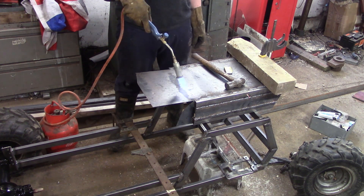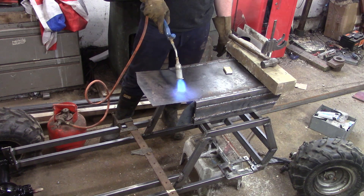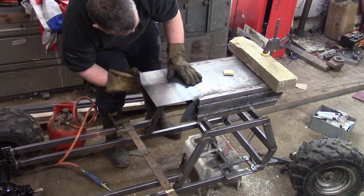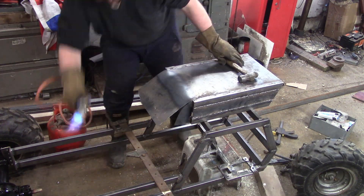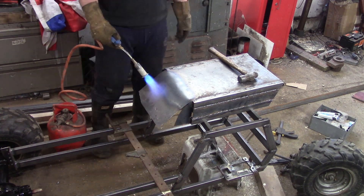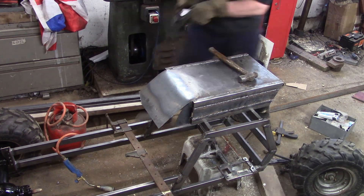This is one-and-a-half millimetre mild steel sheet. Mild steel is nice to work with, but one-and-a-half mil is getting to the point where I couldn't just wrap it around something and tack it in place — I had to put a bit of heat on it. That lets it follow the contour a lot easier. Even then I didn't get it tight and had to clamp it in place to make the weld, but I've got a nice radius in the end.